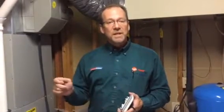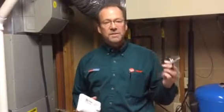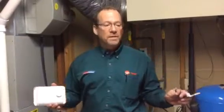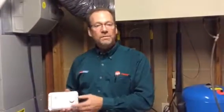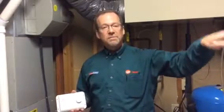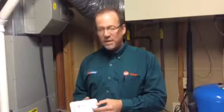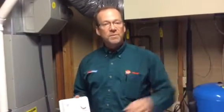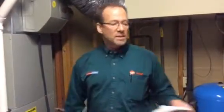Instead of adjusting that all the time, they have outdoor sensors, and you'll find out the quality of your windows. Usually start at 4 or 5, and that's a good spot, where the windows will stay dry. If they get condensation, you'll turn it down. If you feel you need more, you just turn it up. Once you find that point where the windows stay dry, you're done. You never have to touch it anymore. So it's a great system.